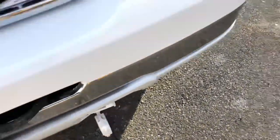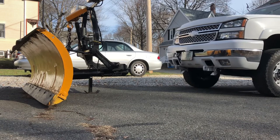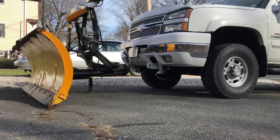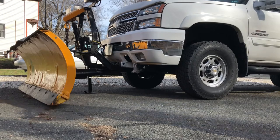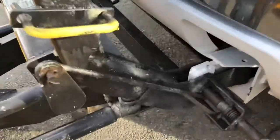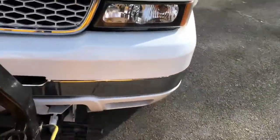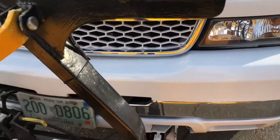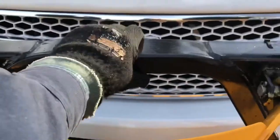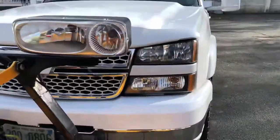Some people can get it on the first try, some people struggle, so I'm going to show you how to line this up from the cab. Granted, I make it look easy, but sometimes it's not — I've been doing this for years. Once you're lined up into the push plates, I like to put a little pressure here with one hand and push up on the unit. You can see it's going to move just a little bit, and that helps guide the pins in.